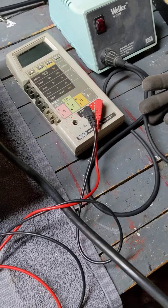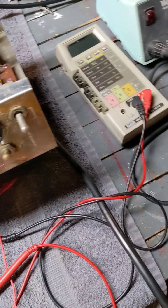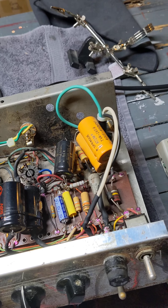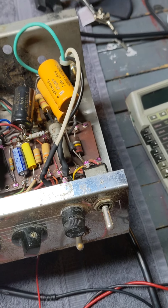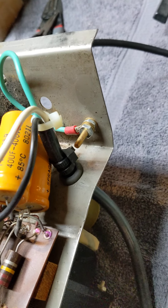Also got a new power cord, because the power cord they used is, I think, a 12-gauge power cord, and the wire inside these insulated pieces is physically too large to attach onto the switch. That's probably why they shrink-tubed this, unless they didn't know what lug to hook it back up to. New power cord with a proper strain relief, not some zip-tied mess.